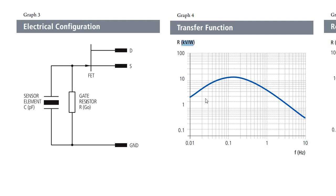That's why — if you've seen the Mythbusters episode where they test these sensors and how slowly you have to move not to be detected — it's next to impossible. They've got a bandwidth that goes right down to 0.01 hertz and beyond. You would have to move incredibly slowly through these things not to be detected. High-value resistors on the input also generate thermal noise, or Johnson noise, which can be a real issue — so there's a delicate balance designed in so that noise from the sensor, the FET, and that resistor doesn't cause false triggering.